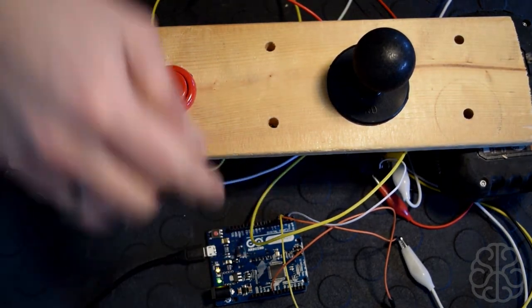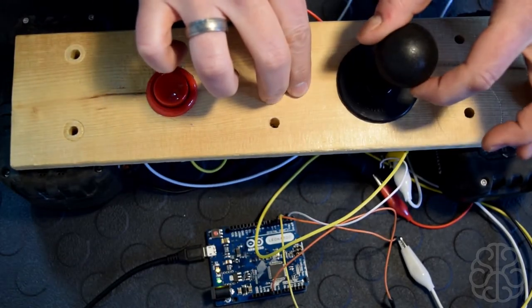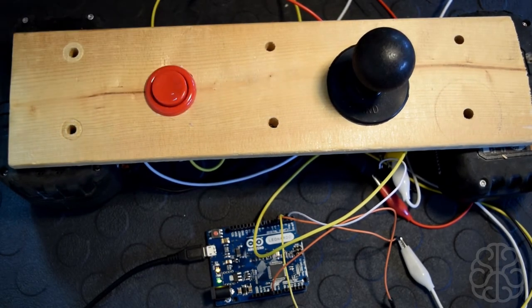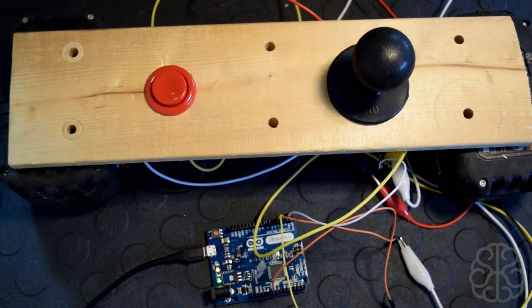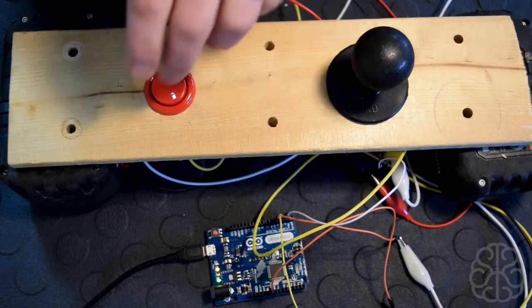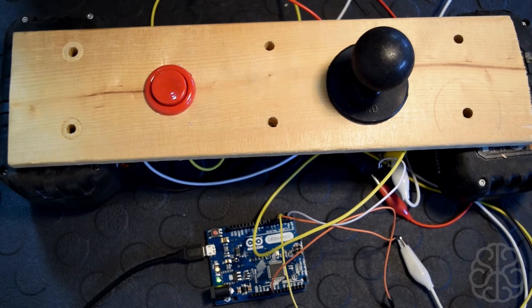We're using three pins: pin 3 is connected to the switch when I go left, pin 4 when I go right, and pin 6 for the button. The ground goes from each switch to ground. The code is fairly easy because we're only using left, right, and fire since Galaga only has left/right movement and a fire button. If you're playing other games in MAME you might need more keys, but it's basically the same — you just add them in the code.